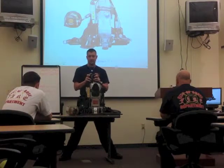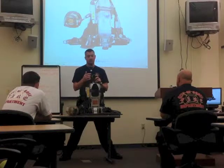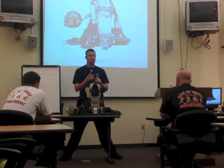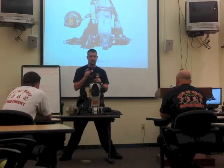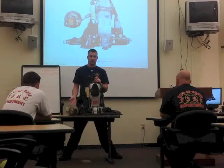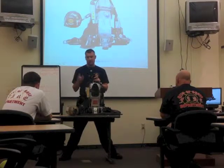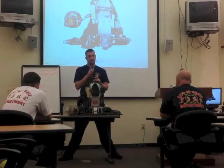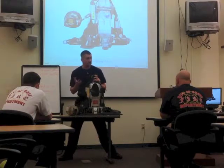This right here is called your HUD display — heads-up display. The lights work with a total of five lights: two green, one amber, and one red rectangle, and on the far side one small circle red light. These lights give you a visual aid when wearing a mask to tell you how much air is roughly in your bottle. Two green lights means full — from 4,500 PSI all the way down to 3,375 PSI. At 3,375, one green light goes off and you're at three-quarters of a bottle.